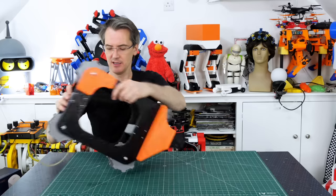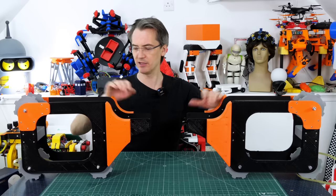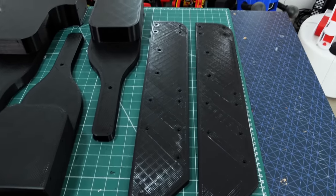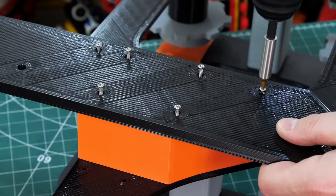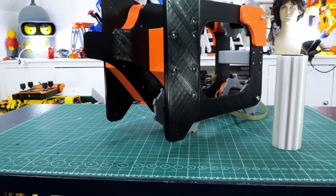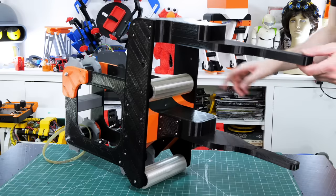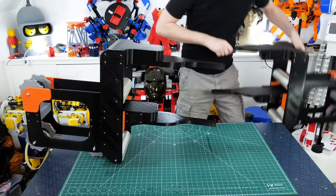I think we're going to have a motor in each side, so as well as one of these I've actually got two that are symmetrical. There's a big hinge thing in the middle and we need to put those other rollers in — this thing's going to work out pretty long, about a metre and a half. We need some more massive chunks of plastic again on the long bed with that 1.2mm nozzle. These big long plates are screwed onto the sides and are basically going to hold those TPU rollers, which fit at various places — there are actually three on each side but I'm probably going to leave the top one off because I don't think we really need it.